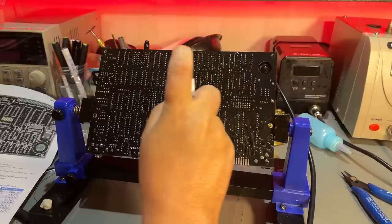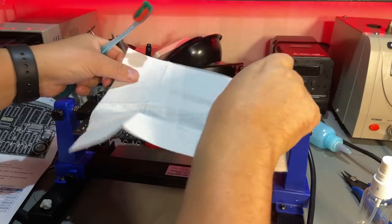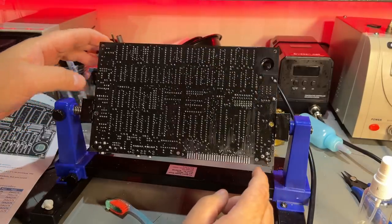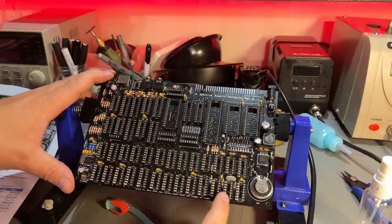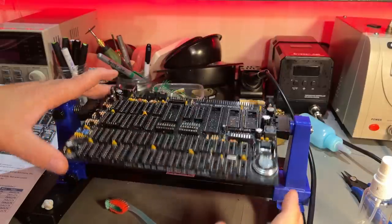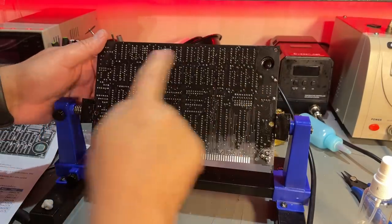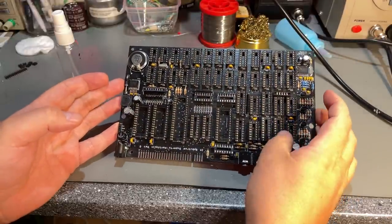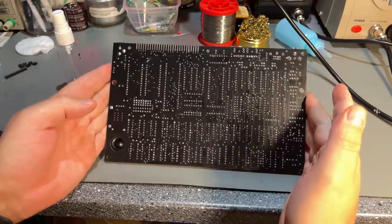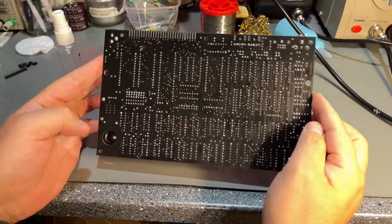Now it's time to do a little bit of cleaning of the flux. I want to have this board clean and shiny. I'm going to take this and clean it in soapy water, because that's okay when no active components are on — a few passives can stand a little water. This speaker I should have perhaps waited on, but I think it's waterproof as it's made of plastic. I'll try not to splash a lot of water on that side, just clean the back side. Looks absolutely clean now — no leftover flux at all.